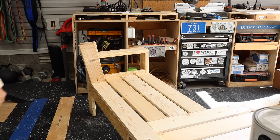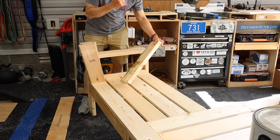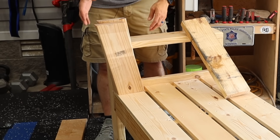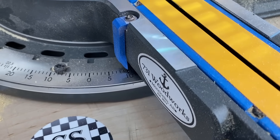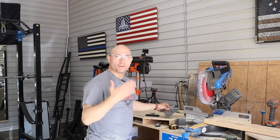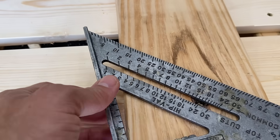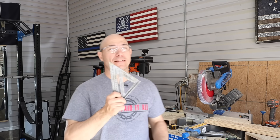I'm working on the back pieces — the back angles. You should have some drops from earlier cuts you can use. This is a seven degree angle and this is a 10 degree angle — you can see there's a little bit of difference. Ten degrees will be a more comfortable angle so we're going to go at 10 degrees. These are 17 and a half inches tall. If you don't have a miter saw and you still want those 10 degree angles, you can use a speed square to get the same angle, mark it, and then cut it with a circular saw — just be real cautious about getting that angle correct.